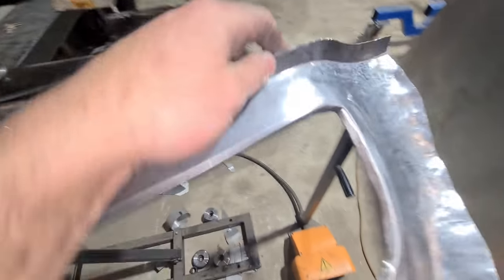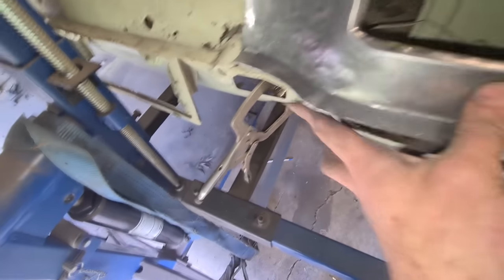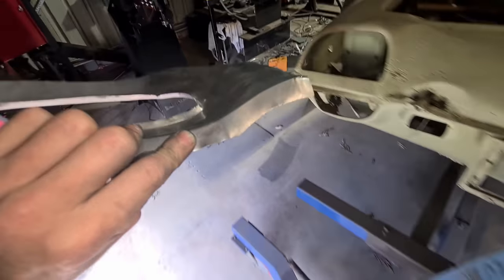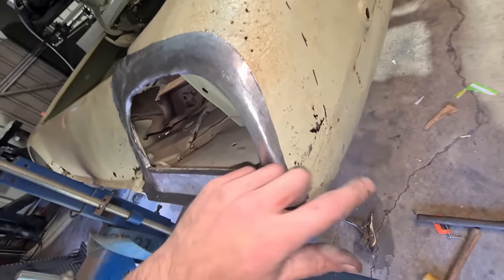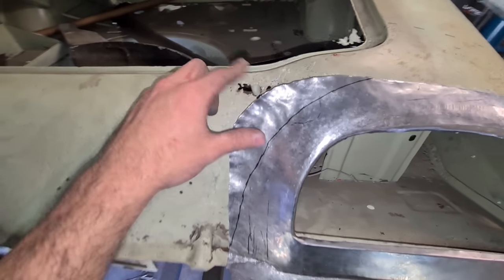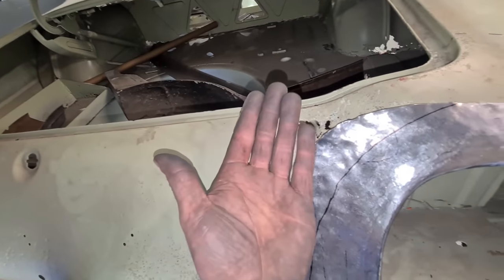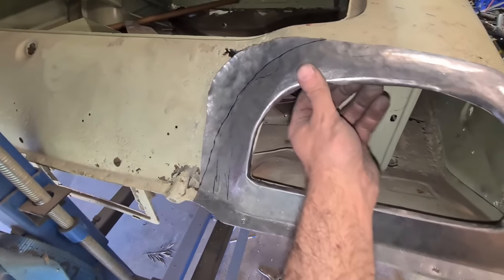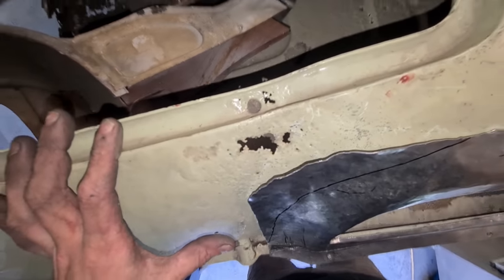I can go back to the bead roller and tip that flange on. It's telling me there's too much material — got to shrink that area and I'm assuming I've got to shrink this corner as well, so we're way off. I'll keep that little flange and shrink to pull it back in the right shape, then over to the kick shrinker — nice and easy. Trimming the panel down released a lot of this corner and now I think I'm just going to trim it down because there's no point trying to stretch this all the way down to meet this when I can just pull the panel up. So much easier to shape that one up towards this than to bring this panel down.